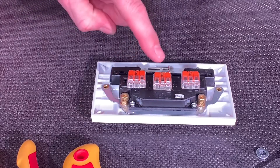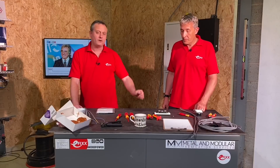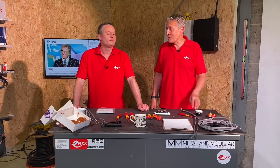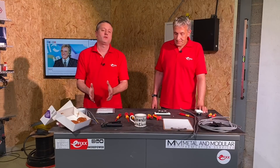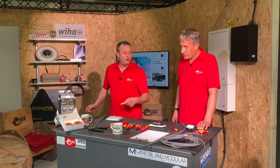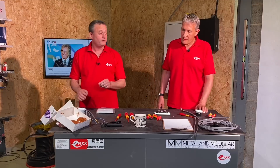You've probably got ahead of the storm — I can see you've attached a 3-and-a-3 to accommodate your connections. Any feedback on that? The feedback we had was obviously an additional terminal for the CPC, just so you could put that controversial lead to the back box. So your socket outlet in concept will accommodate the cables of a standard 13 amp socket outlet, but as I look over at your cables being stripped and mine being stripped here, I've got a funny feeling you're luring me into a race, Gordon.